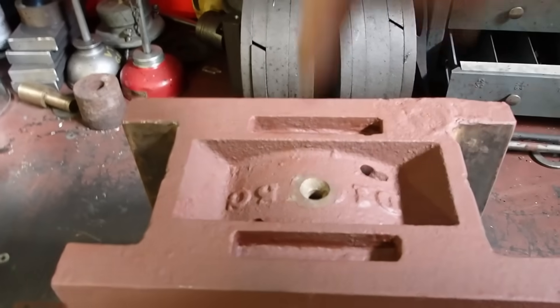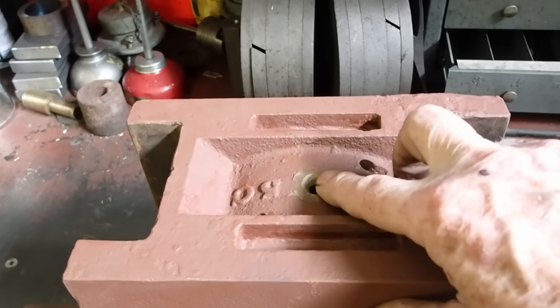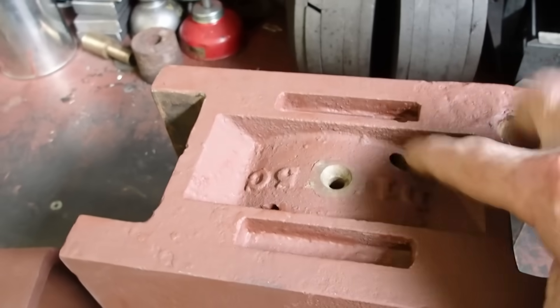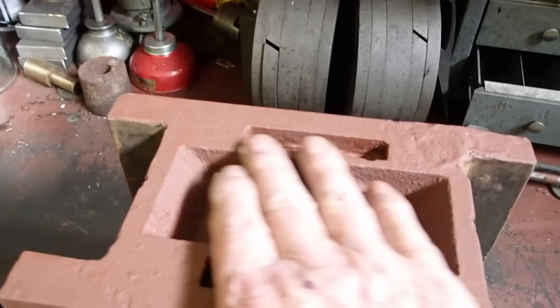To keep the brasses from moving laterally, part of the procedure is to put one or more pins in from the top down into the brass. For some reason, whoever did this last time put an oil hole in here — that's not normal. This oil hole can't be reached; from the engine's perspective looking through the frame, you can't see or access that hole. The proper design has an oil hole here and here, going down through the brass into the top of the brass, with a cotton or wool packing to keep dirt out.